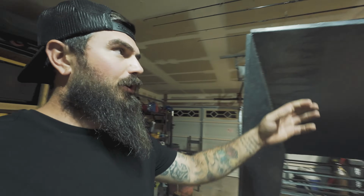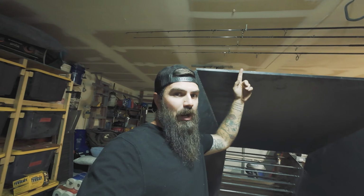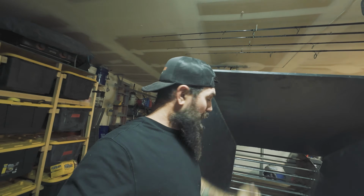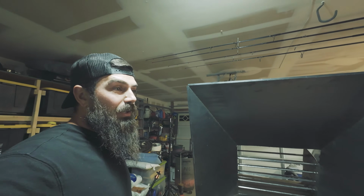Like I said, we're not gonna go with the round steel pipe here for the grizzlies. We're gonna go with angle iron. It sounded like a burp. It did. So we're gonna put the angle iron on, and the way this is gonna run, from how we're seeing it, is we don't want anything bigger than 1 inch diameter getting through this box. Anything smaller should go right through, hit what it needs to hit, and break up that way, and everything bigger than 1 inch will fall off the back.